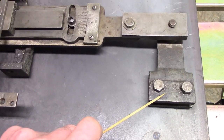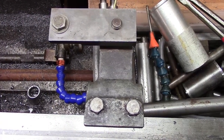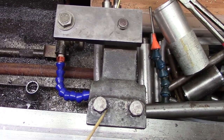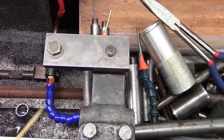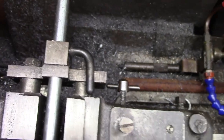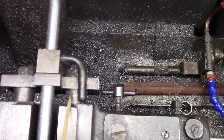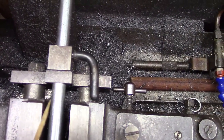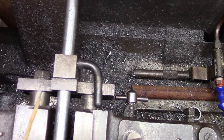This piece clamps to the side of the rail. I'm just going to try and point out each section - here's the anchoring section on the rear rail, and that's bolted down to lock. This then attaches to the main body. The attachment to the saddle is here. What you can see here with spacers and a block - that's what I normally use for a cross slide stop.